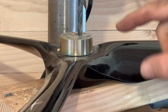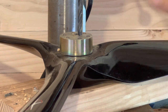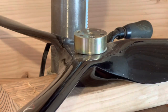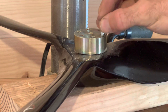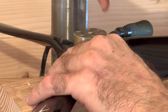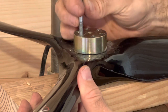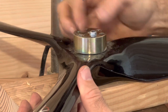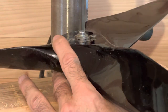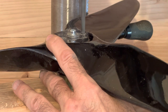Make sure that you don't take this off until you've cleaned out the holes, tested them, and run the bolt that's going to be used through them — you want to get this right the first time. Now I'm going to run this prop bolt through from the other side to make sure those holes are cleaned out well enough that I won't have any issues. You want it to be fairly snug. That one's cleaned out nice and good, and then I'm going to check it from the other side — just clean those out a little bit, not much.